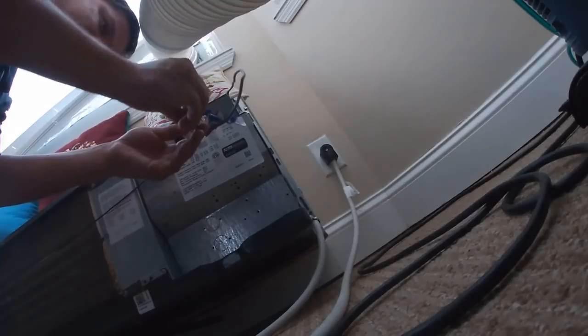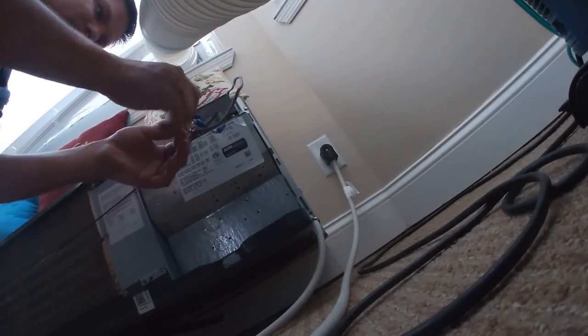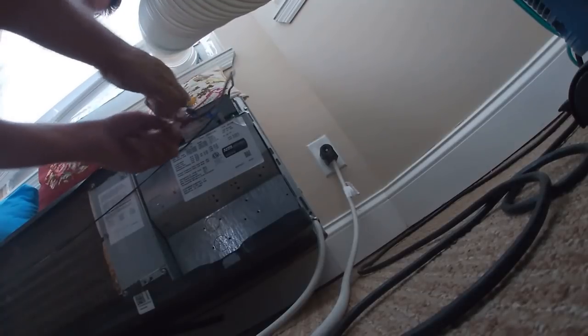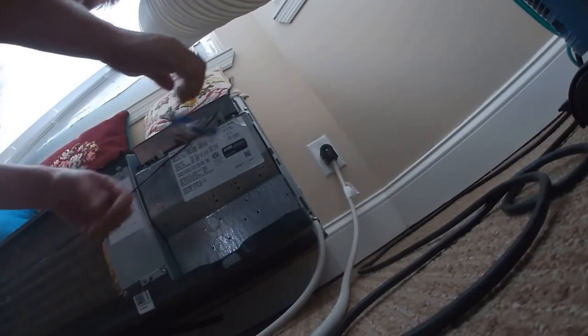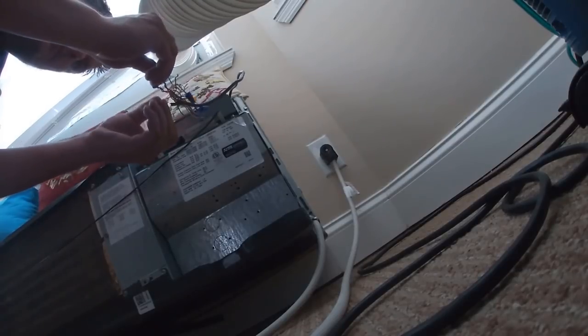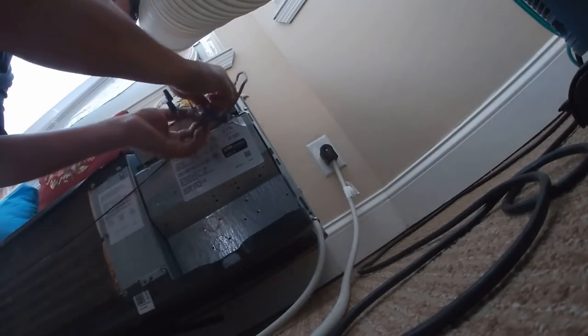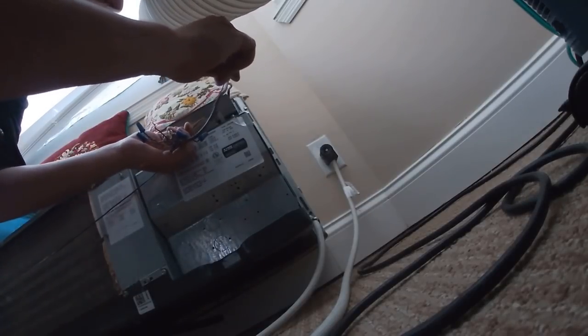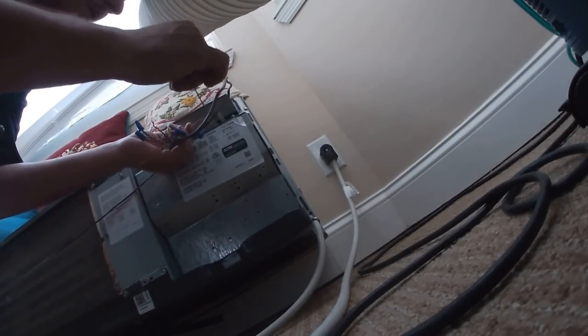It just ticked over — see that flash? Common hooked to orange and black and blue. On these PTAC units, red to red and green to green don't mean the same thing. See blue right here? That's the common wire.